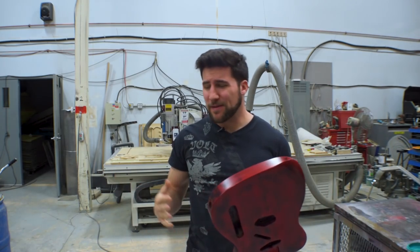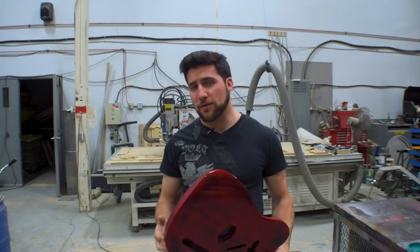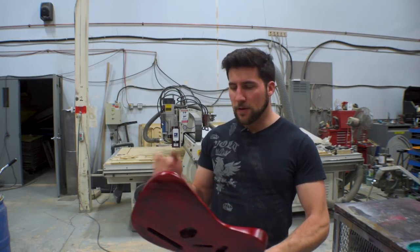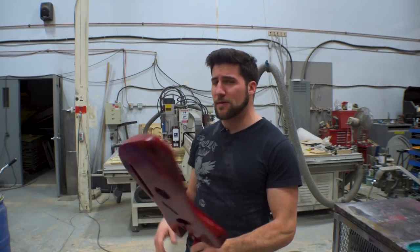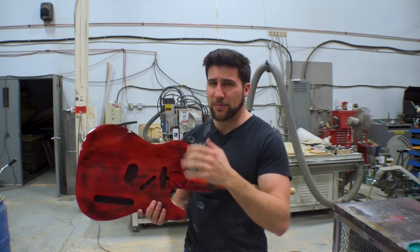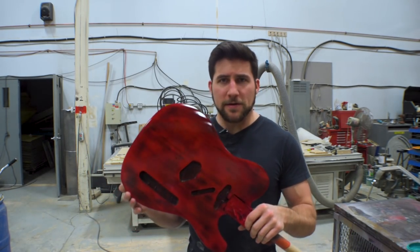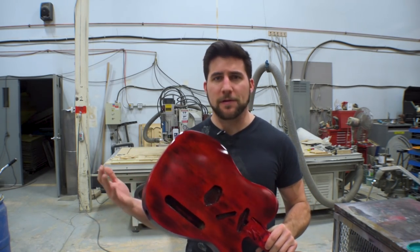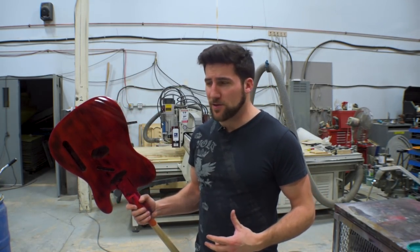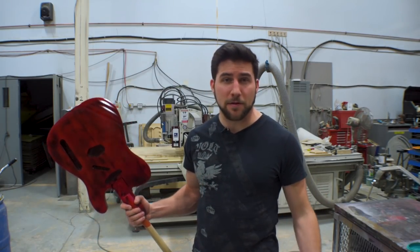So as you can see, there is no magic to that. You simply put it on the normal way — don't spray it too heavy. I did three passes right there in one session, not worried about it at all. Stuff's nice and dry, and it's only been probably five minutes. Now, I said lacquer takes a long time to dry — let me clarify. It dries for a very long period of time; it takes about a month for the solvents to evaporate completely. But nitrocellulose lacquer flashes off very quickly, so it's dry to the touch within a couple of minutes. We've got a nice coat here — decent gloss so far, and this is going to be really easy to polish out. It was gloss when I started, it's gloss now. No worry about adhesion because it's lacquer — I just had to make sure the surface was nice and clean.